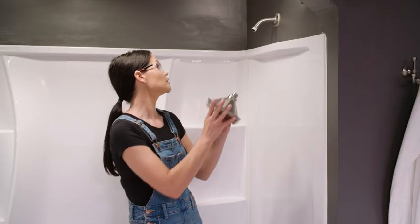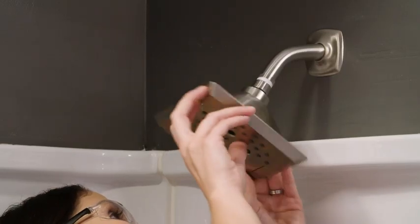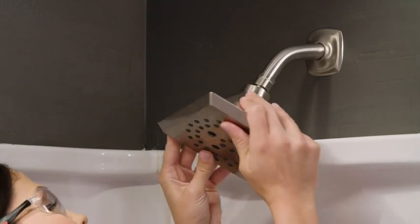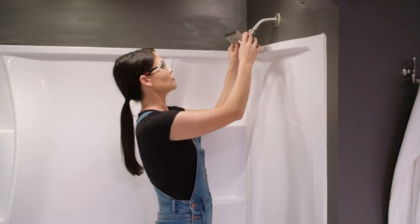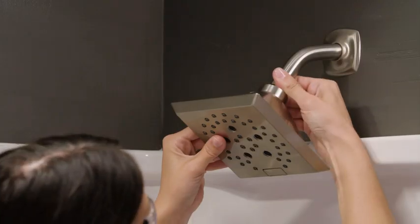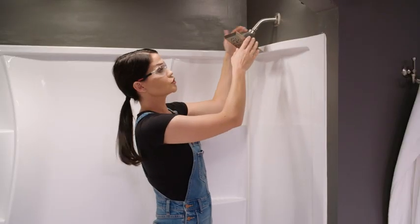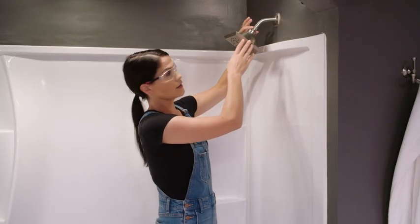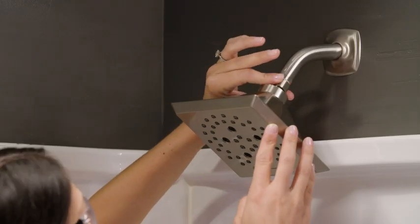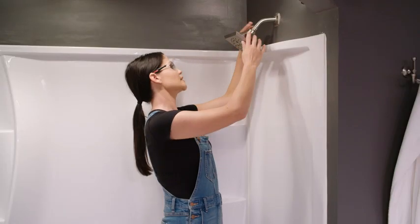Now I want to make sure it's pointing down and then I'm going to push my flange back until it touches the wall. I want to make sure that that's nice and tight everywhere. Now it's time to install our shower head. I want to make sure that this gasket and screen hasn't fallen out — in your packaging, it comes with these right in here. Those are both in. So now we're going to hand tighten our shower head onto the end of our arm.